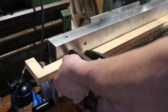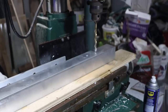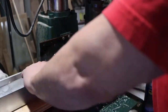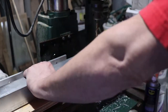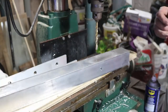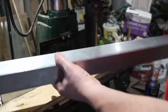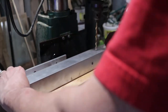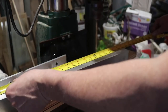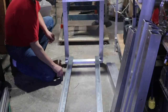For the longer legs, I cut a piece of plywood into an L-shape so I can do the exact same thing as before, except now the slide is longer. I can adjust, measuring from one side, so that if there are any small incremental differences in length the piece won't have any variation in angle. I know it's probably a little too picky for aesthetics, but I don't want any angle showing up. If there's an angle it will catch your eye and make things seem not square. Not too many people can see the difference between a sixteenth and a thirty-second.